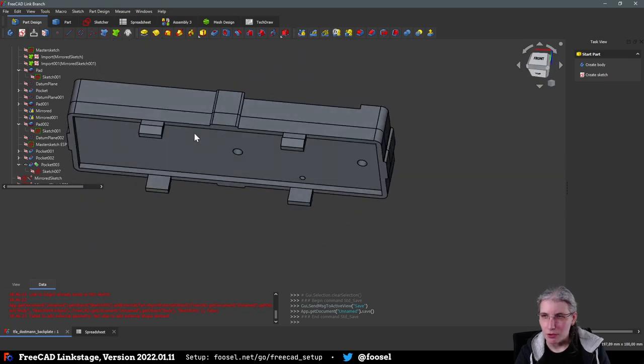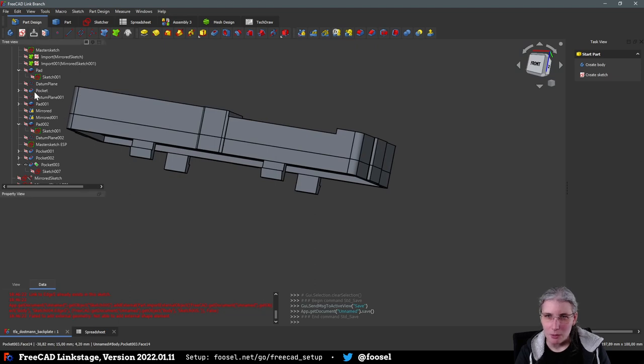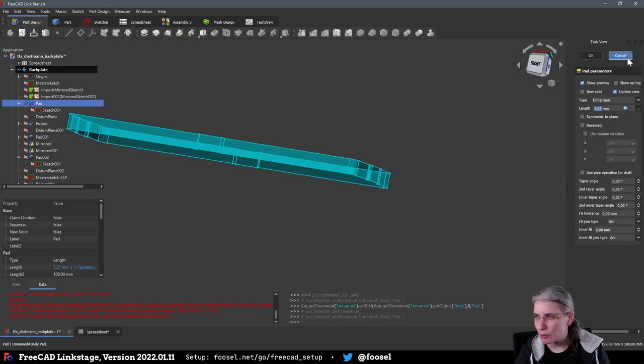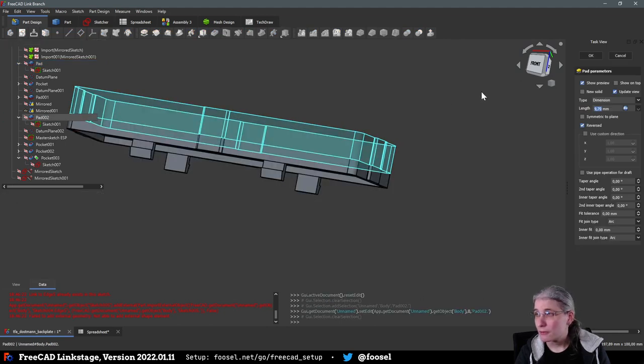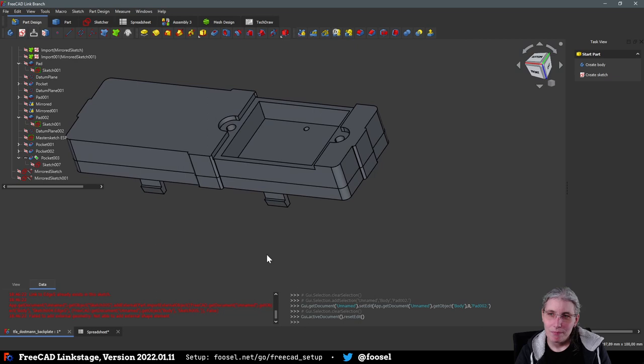Just realized I should actually also make sure that I have screws that are of the correct size. How high is this now? We extruded this first by 5.25, and then we extruded it further, 5.25, 9.75, so it is 14.95, so almost 15. Do I have 15? I think I have 16 and I have 14. Yeah. Ugh, that is annoying.